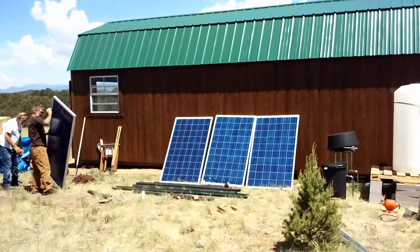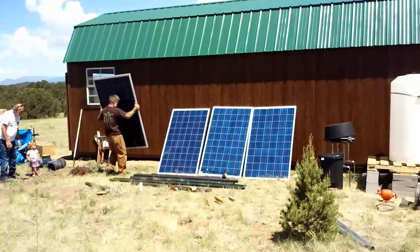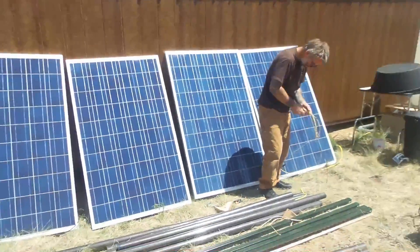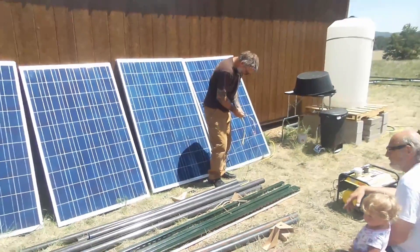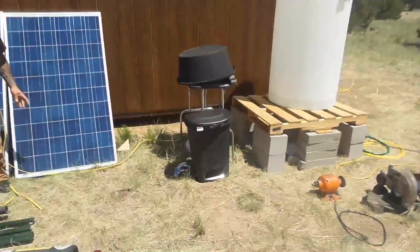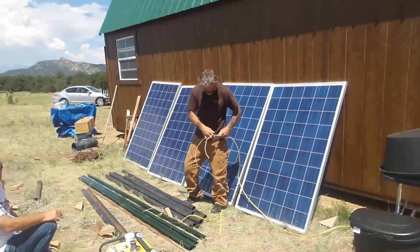Today we'll pick up where we left off. Dwayne's fridge has been running for a day and his batteries have had no charging at all. It's not a problem, but the batteries haven't even been topped off since he received them. He makes a temporary solar array by leaning four panels against the south wall of his shed, wiring them in series, and then running them to the charge controller located inside the inverter.